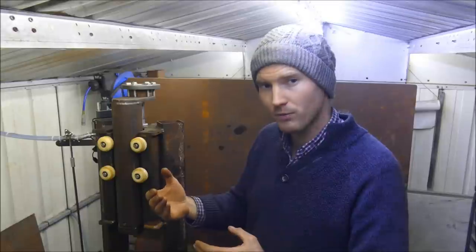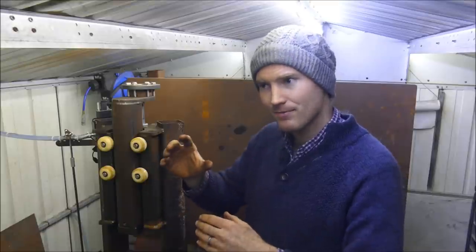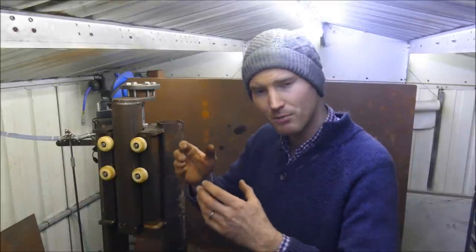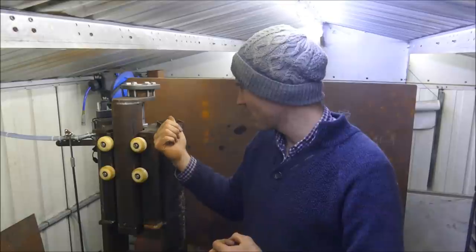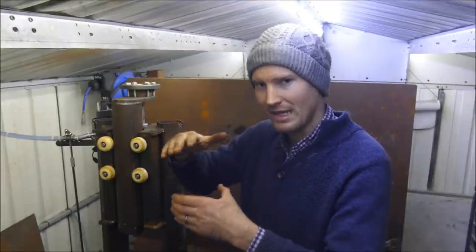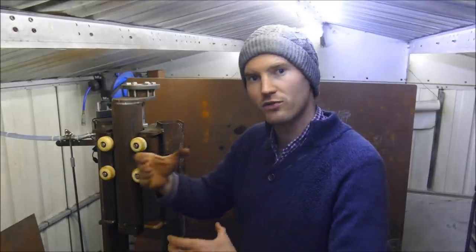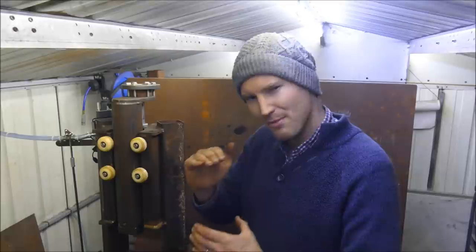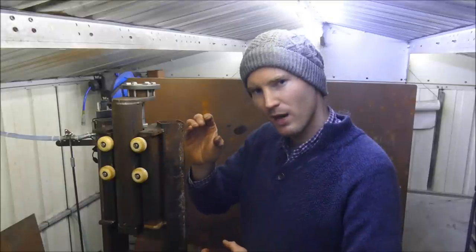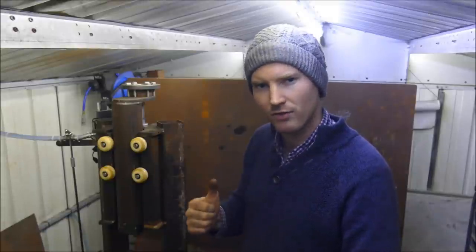So before, we had it directly linked, which worked, but it means that any misalignment of the fabrication means that any flexing or movement will then incur on the seals and the rod of the cylinder. So having the new top linkage takes away that, but it's semi-rigid. So it's not too loose that the hammerhead is then able to move too freely about. It's got semi-rigidity. So it still keeps everything nice and straight, but where push comes to shove and there's some real forces involved, it's able to move instead of the cylinder rod.